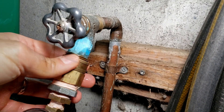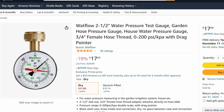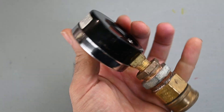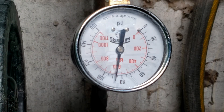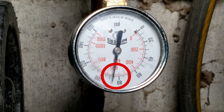You'll want to test your water pressure, which can be easily done by connecting a pressure gauge to any hose connection around your home. You can either buy these test gauges pre-made, or you can easily make one for about $10 using some inexpensive plumbing parts from your local plumbing supplier. You can find the required parts listed in the video description below. If your water pressure reads more than 80 PSI, you may want to strongly consider installing a pressure-reducing valve.